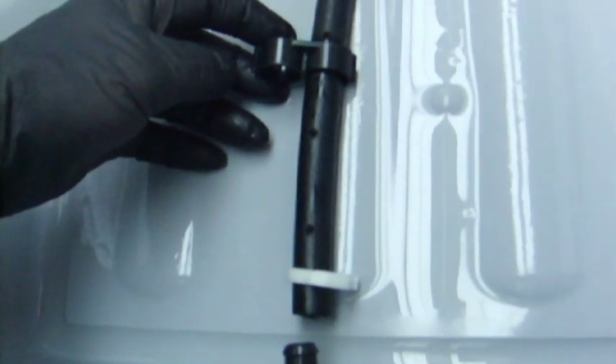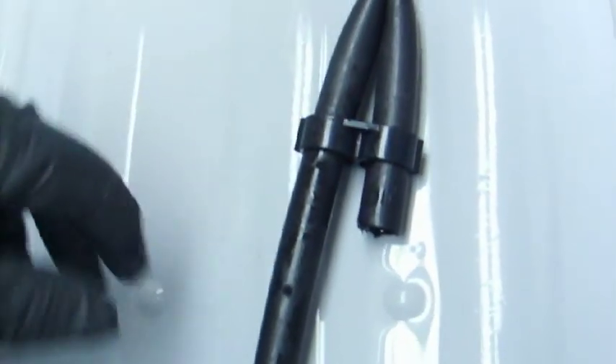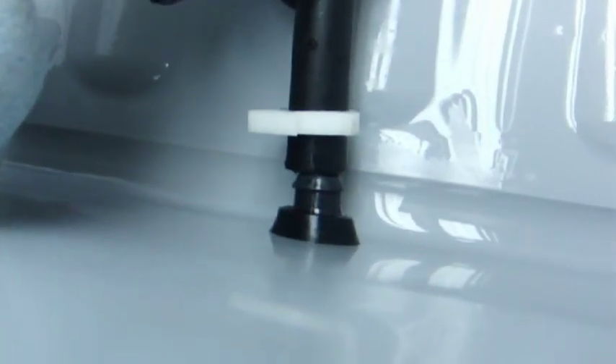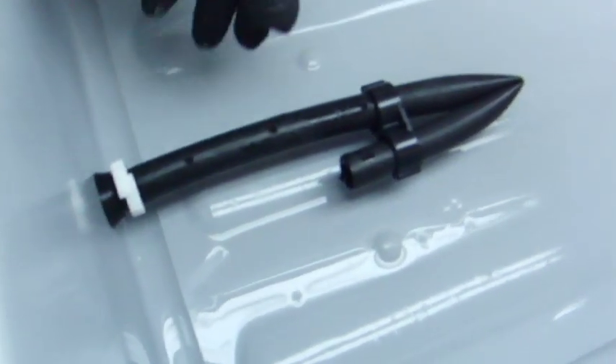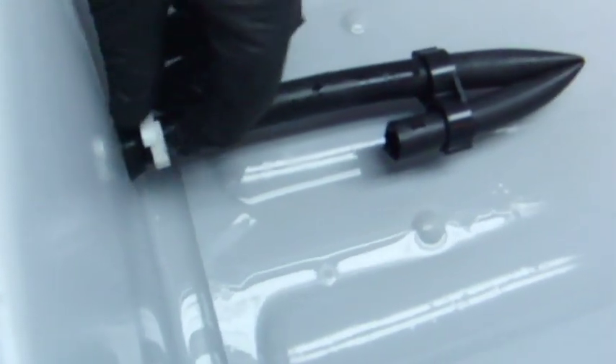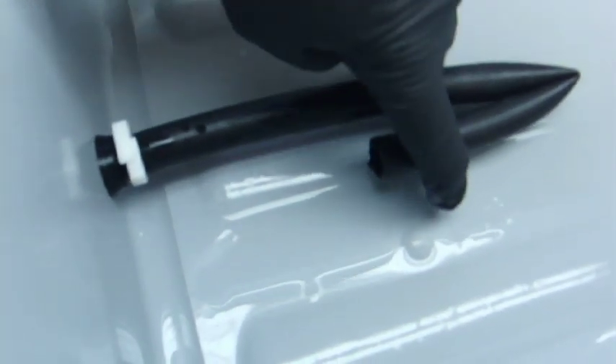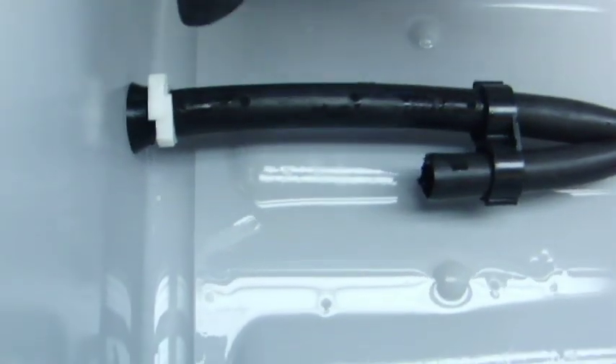So this is what it will look like. We've got the hose with the reducer clamp thing. We've got three holes drilled in there — about an eighth-inch hole. We've got the nylon clamp, and then we just attach it to the end of that half-inch elbow. When that hose is installed it looks like this — hose clamp secured on the bitter end of the elbow. It's pinched off there, so you're only getting this amount of air.